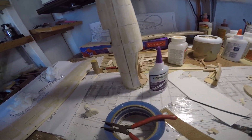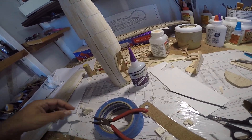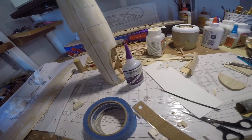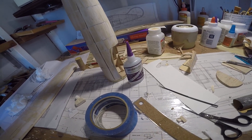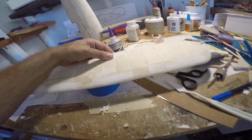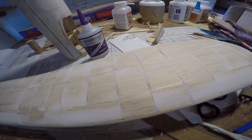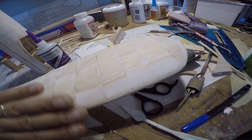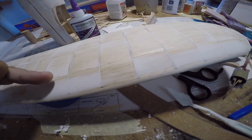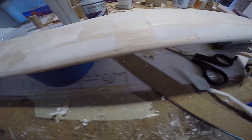I'm working on the wing and putting several coats of spackle on it. The top surface is on its third application of spackle and sanding. The most recent application I was focused mostly on the leading edge - I wanted to smooth this area out and the transition from the leading edge to the main chord area of the wing, from the first stringer back towards the trailing edge.